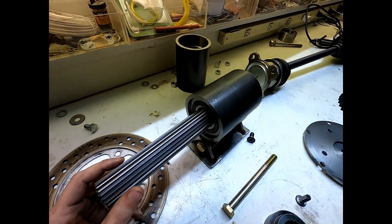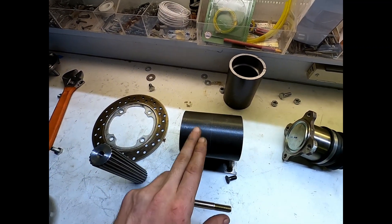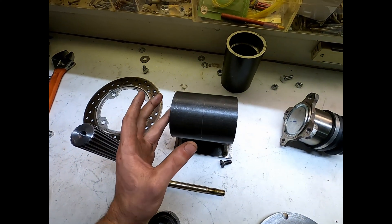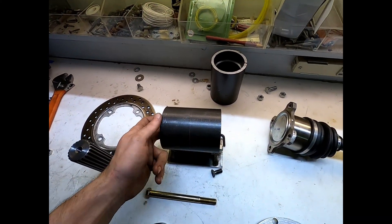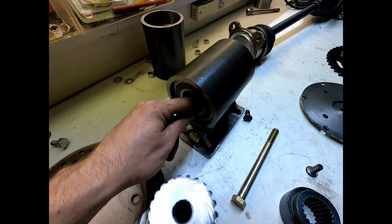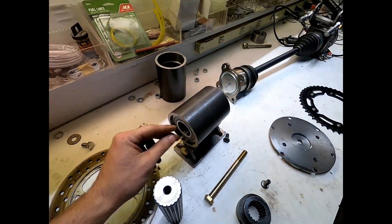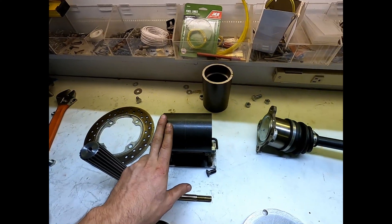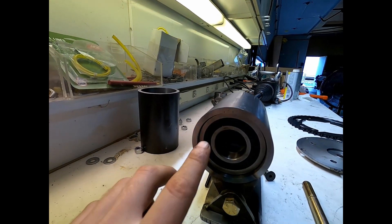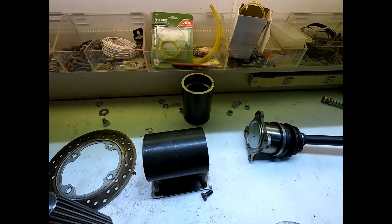I'm going to take the pro's advice and do it that way. The only difference is I'm going to run two bearings on each side, because that's what Jody - the owner at Protodye - does. Right now I've got one bearing on each side and these are really good high-quality electric motor bearings meant for high speeds, but I'm going to run two next time. These are three inch outside diameter; the ones they use are two and a half inch outside diameter, so there'll be less mass and less weight, which is always good.